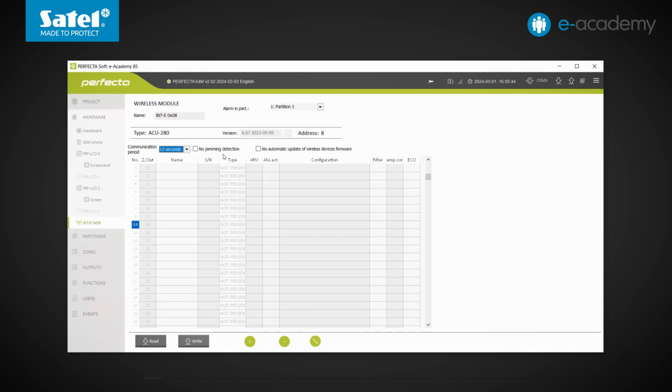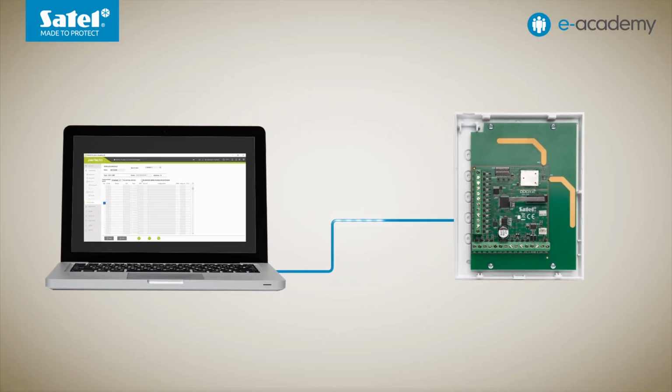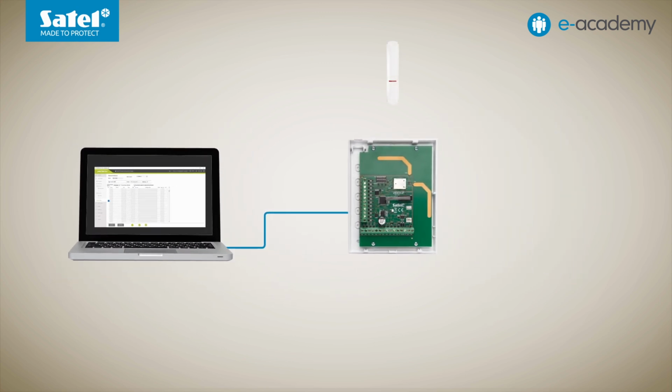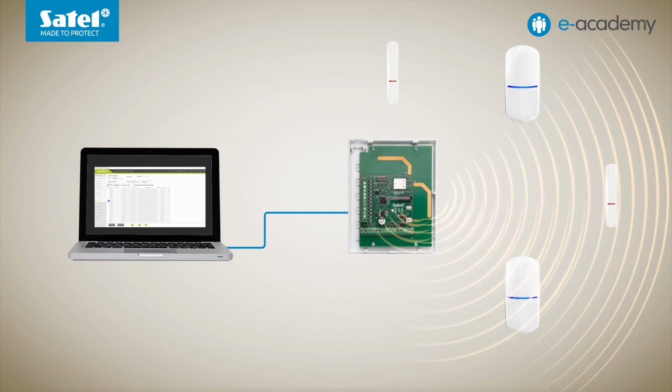In addition, we can tick boxes with which we disable jamming detection, as well as the automatic wireless devices firmware update option. Here, I remind you that in ABAX 2, the All Devices update will start after updating the firmware of the controller itself. It is this module that automatically distributes the latest firmware to other devices.